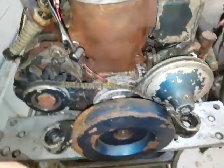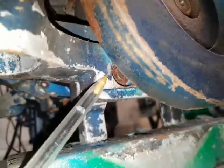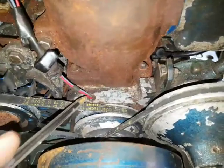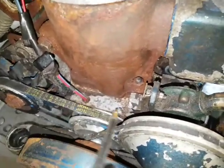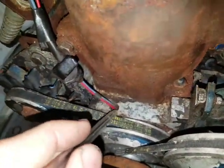You'd have to take off the flywheel, the front pulley. You'd have to disconnect this engine mounting from the engine. Then you'd have to lever up the engine on blocks. Then probably you could get to these bolts to pull that cover off. There'd be a gasket under there, and probably the front oil seal for the crankshaft, which you'd have to be careful not to damage, or you'd have to put new ones in, all to get at that sensor which is filled up with salt water. So I'd be very nervous about that. I think every owner should be thinking about putting silicone sealant in here just in case. Maybe that's a bad one that I've got.